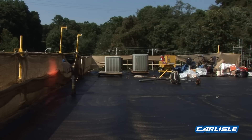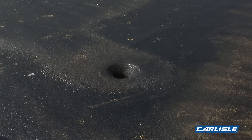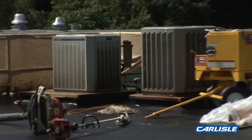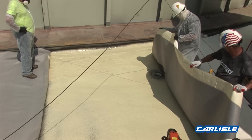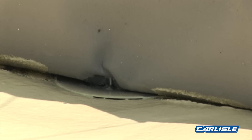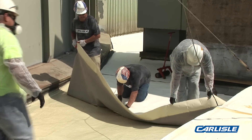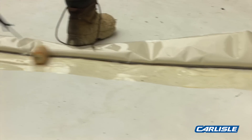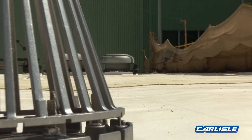The benefit of spray urethane foam roofing is that it's seamless, so it has the best track record of no leaks in a roofing system because it's one piece. You're manufacturing on a roof when you're spraying it, and all the tie-ins are seamless — that's where most leaks occur, on tie-ins and protrusions. The spray foam seals up the roof and provides the best insulation. When we put the Carlisle EPDM rubber over top of the spray foam we have two waterproofing systems combined together. With spray foam and just an elastomeric coating, that coating is not really a roofing system — but the EPDM is — so it's double protection. It's the most durable covering you could ever put on a spray foam roof.